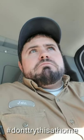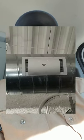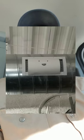Will low airflow hurt them? No — I could put a piece of cardboard instead of the filter and it would just run high static, but the motor would match the situation and you'd just have low airflow. I found some pieces of paper that had been taped over a bunch of the registers, which I promptly ripped down. Low airflow will never cause these units issues on the inside.